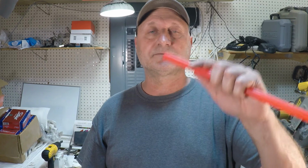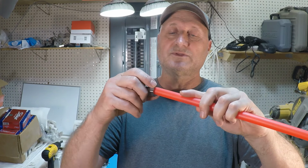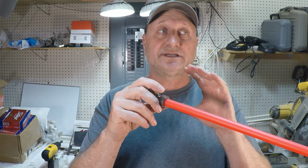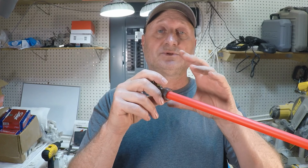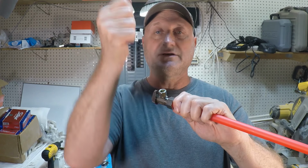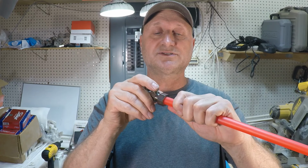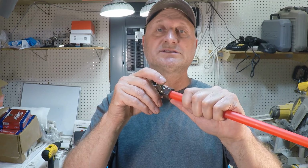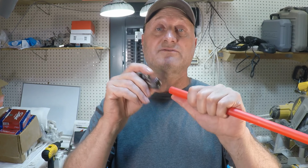there was a huge leak in the apartment above, and what happened was it was under the kitchen sink. It was the hot line with compression fitting, and the hot water line, because of the extreme temperature changes, will expand and contract, and that constant movement, and then the on and off of the water pulsating with the expansion and the contraction, it eventually worked itself loose and it popped off.